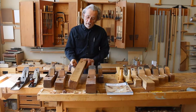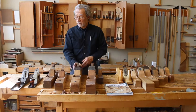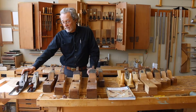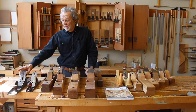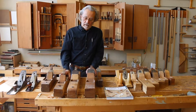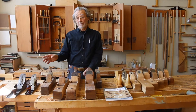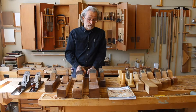They can be found in different blade angles. This is 26 inches, which is actually quite nice for truing boards. The longest Stanley style being made now is the number seven, and that's 22 inches. This is a number eight, an antique — that's at 24 inches. And also, if you get a premium plane, especially looking at the jointer, you're up around $400. You can find these for quite a bit less.